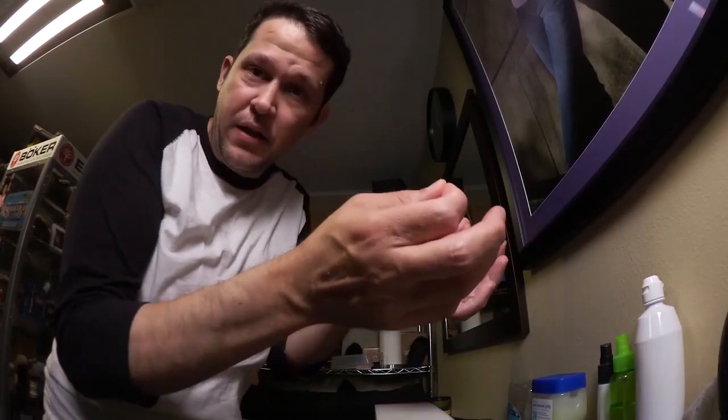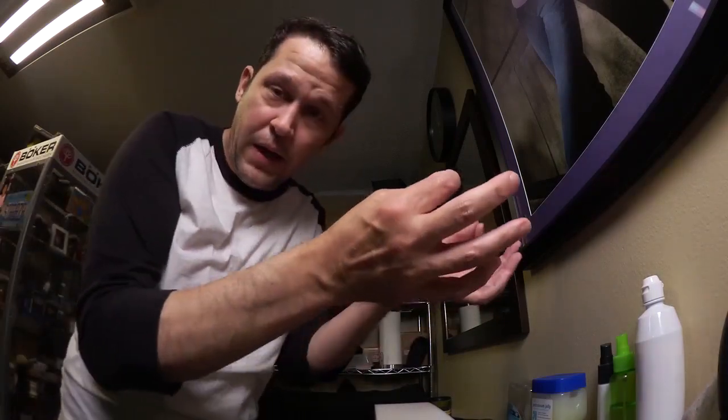And the guy or girl honing would just sit there and move that thing very slowly, you know, 30, 40, 50 RPM, something very slow like this, and they would hold the razor against the wet fine, small hone, and that would be step number one of thinning the razor.